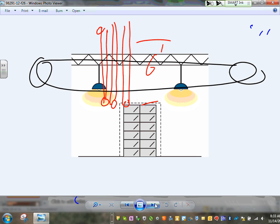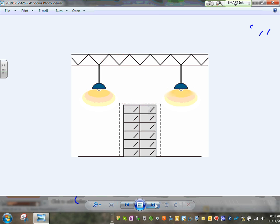Very, very important, guys. The last thing I want to talk about, guys, is that in the electrical room, the code requires you to have illumination. You have to have an electrical room light. Makes sense, right? And that light cannot be on an occupancy sensor. You cannot put this light on an occupancy sensor unless you have an override, a switch. Here's this, here, and here.